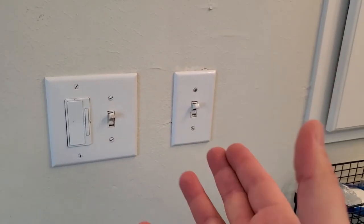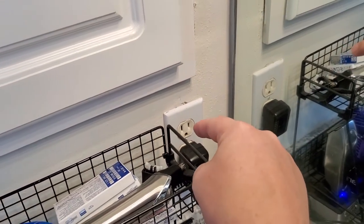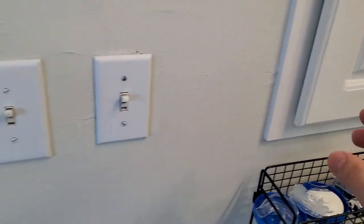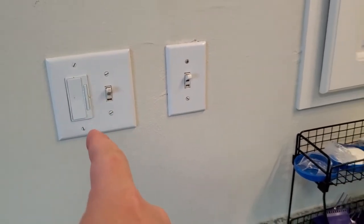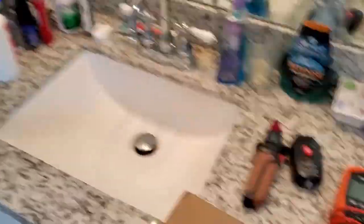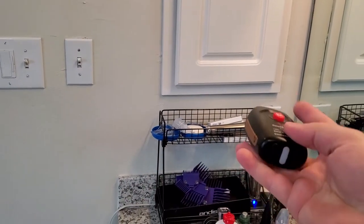But where is it getting the power from? I would normally assume it's coming from the lighting circuit right here, or from this outlet — which you can tell is not a GFCI, meaning there's a GFCI someplace else. I had power over there, but I didn't have power here when I took it open. I did have power on this lighting circuit, and there was no continuity whatsoever between these and that switch.